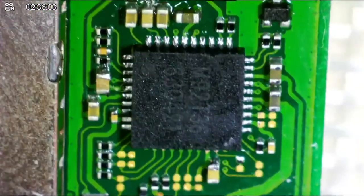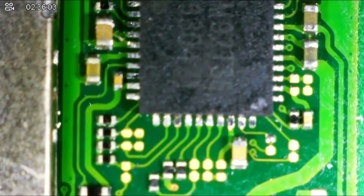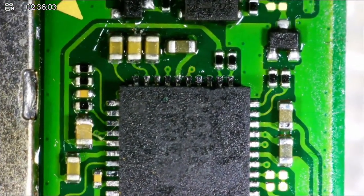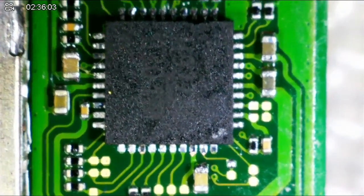So I'm back to having no shorted caps or any issues. I could have not done that M92 chip very well. I mean, it seems to look okay. I didn't blow any components off. That's a plus for me. I thought for sure I was going to blow off some components, but I didn't. So all I can think of is reflowing that chip and trying it again, and if that doesn't work, change that P13 chip. That's what I'm thinking.